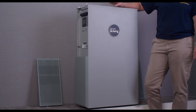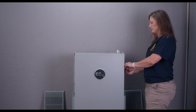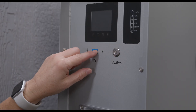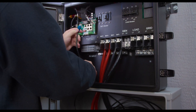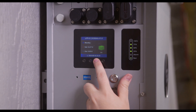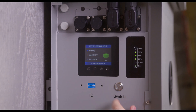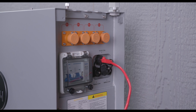Let's look at how easy installation can be with the PowerPro. Keeping safety first, always remember to turn off the power button and flip the breakers before connecting your battery cable. The voltage between the bus bars needs to be zero volts to set up the communication protocol, so we will not plug in our battery cables just yet. We need to make sure that the dip switches are all in the up position before we can adjust communication settings. With the communication cable connected to your inverter, the wall mount's BMS — that's Battery Management System — is able to have closed-loop communication with the 18K as well as a variety of other inverters on the market. Your communication cable will be plugged into the communication port where it says RS-485 CAN.